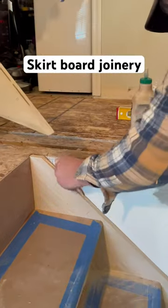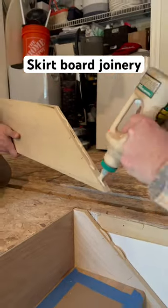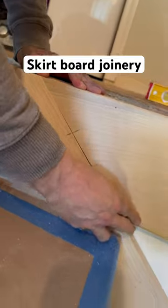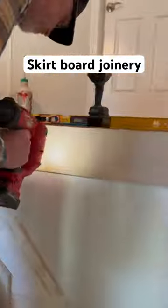Just a quick short showing you how we attach our stair skirt board with our rim skirt boards. We use number 10 biscuits, some wood glue, some 16 gauge brad nails — two inch — nailed right into the joist behind it.